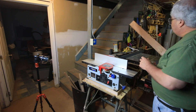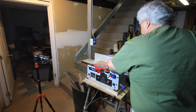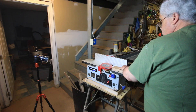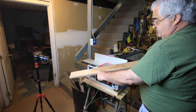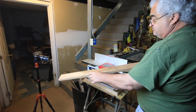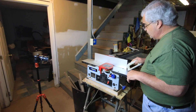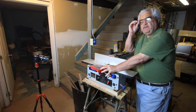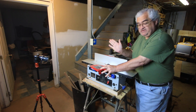That should solve that. We just want to keep running through until we get a solid cut. I've killed the volume here because you don't want to hear that machine screaming — I'm just running several passes on this face to get it closer to flat. As you can see, we just have this area right here that still hasn't made contact, so this is our low spot. We've got to keep taking these high spots down until we get to the low spot. I've got a couple of curly lines here — that's a chip in my blade. I ordered a sharpening device and an alignment jig for that. I'm going to move the fence in a little bit to hopefully eliminate some of those nicks.